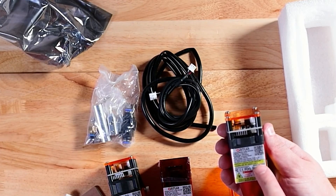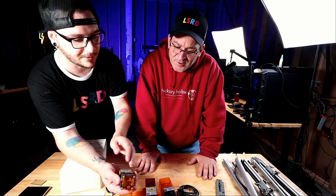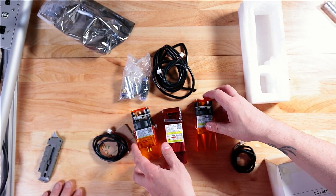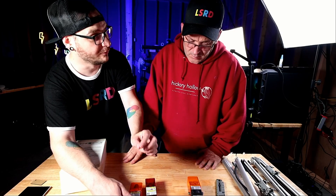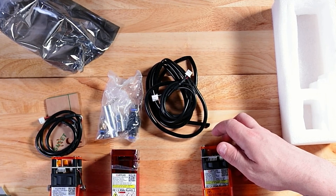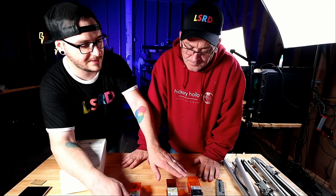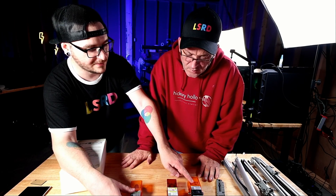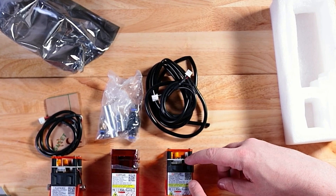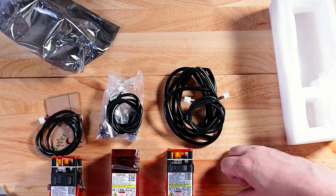Here it is — this is a 5.5 watt beam, but it's a longer focus, so it's better able to cut through. This would be like using your 4-inch on your CO2. So we have now the 1.6 watt 2-2 with a really, really small dot size — weak power, so you have to go really slow. Next up, the 5.5 watt module, the LU 2-4 short focus — for marking, not for cutting, getting slightly better detail. It's kind of the middle-of-the-road module you use for everything. Then lastly, we have the 2-4 LF — the long focus module, specifically for cutting with your air assist supplies.